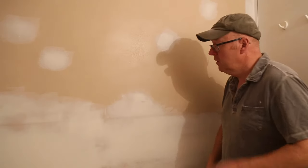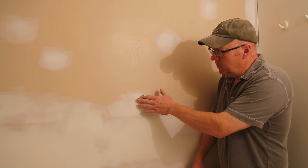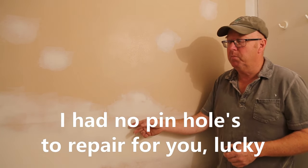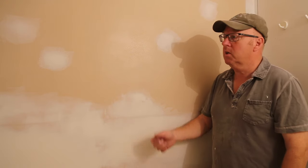This is that spot on the upper part of the wall that was peeled prior to the last paint job, but the mud has filled it in really, really nicely — you'll never see that again. Mudding is all done, sanding is all done, really happy with it. If you notice a scratch or something, don't try to fix it right now — prime it first, then go over it with a little bit of mud, especially on the pinholes. Pinholes are pretty well impossible to fix at this stage; prime it, a little bit of mud over the pinholes, light sand, paint and you're done. Next step: let's get some primer on this. I just got started doing a little bit of cutting in and now it's time to do some rolling. Thanks for watching, stay tuned.